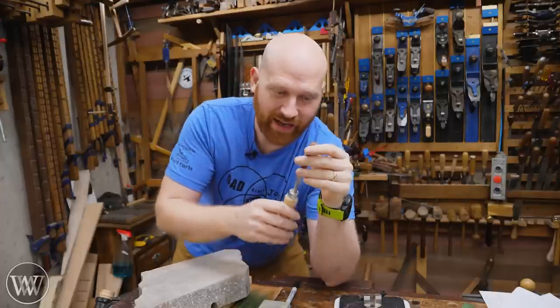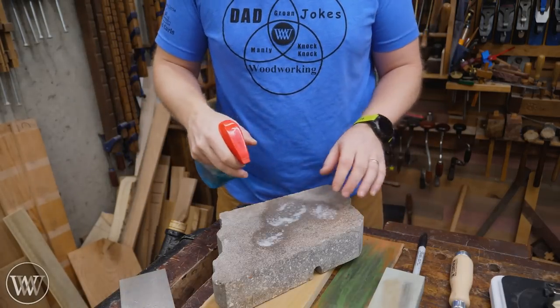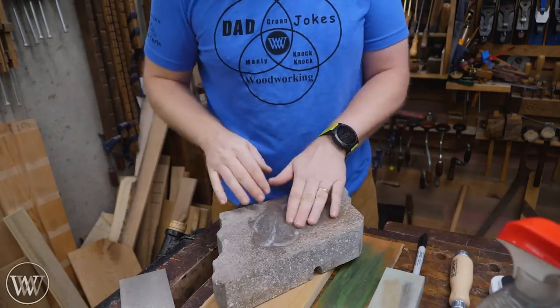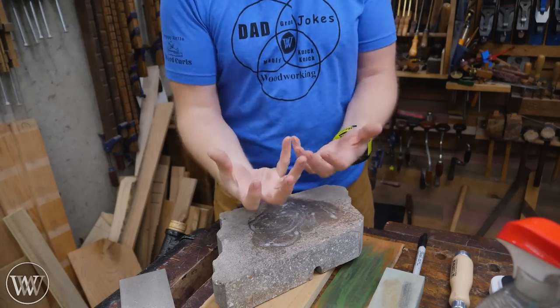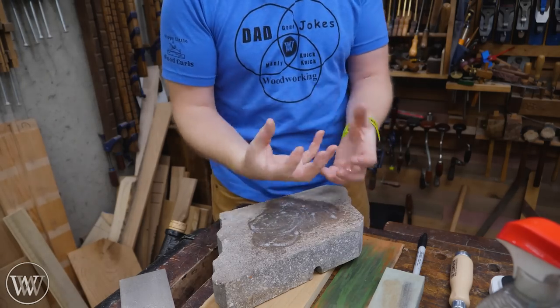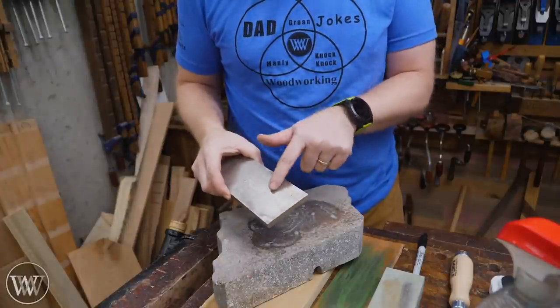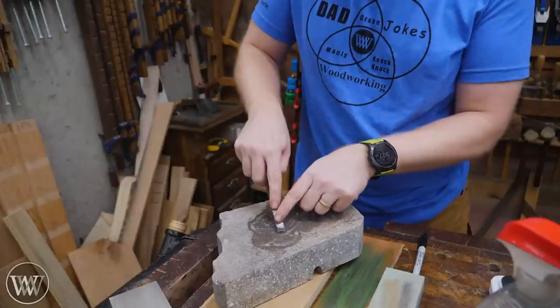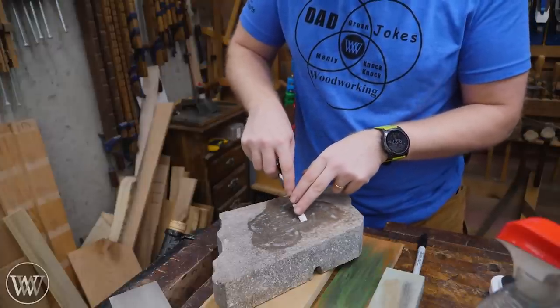So the question is: can we actually sharpen it up on just this stone? For natural and man-made stones, you do need a liquid in order to create a slurry, and that slurry is what actually does the grinding — it's a paste moving around on there. It's not actually the aggregate that's grinding it off; it's the slurry on top. That's why diamond stones cut differently than natural stones, because diamond stones don't create a slurry — it's just the aggregate sticking up. Then I'm going to bring it in here, and just like normal, with very light pressure — I'm not going to be pushing down hard on this.